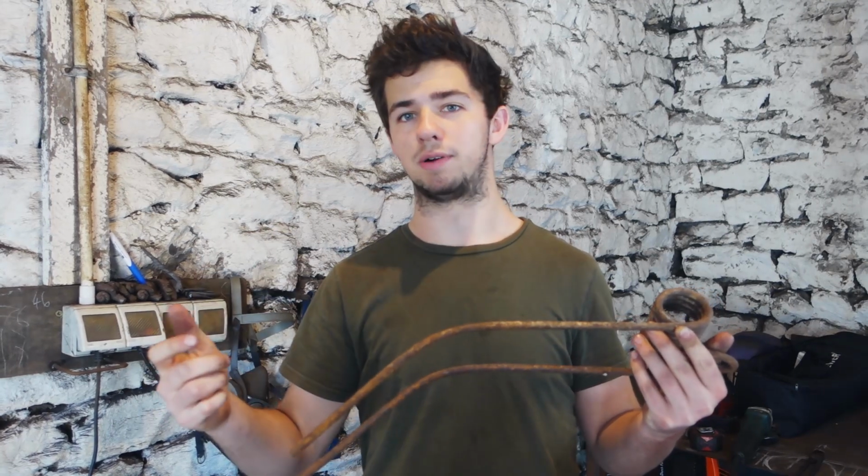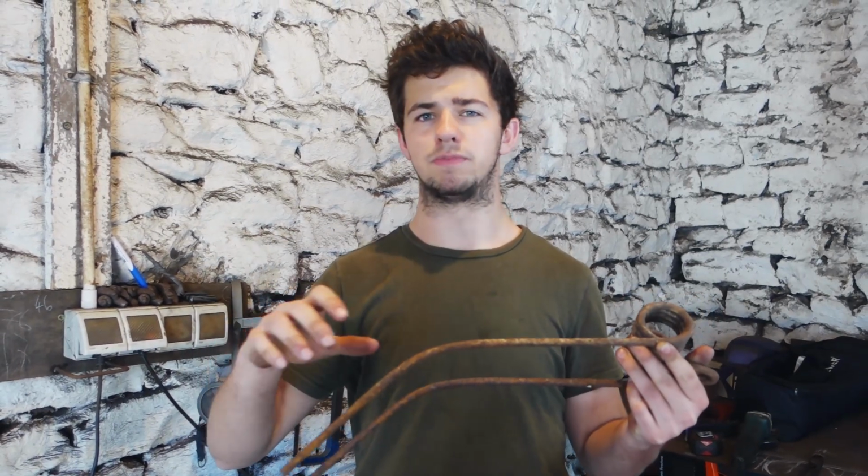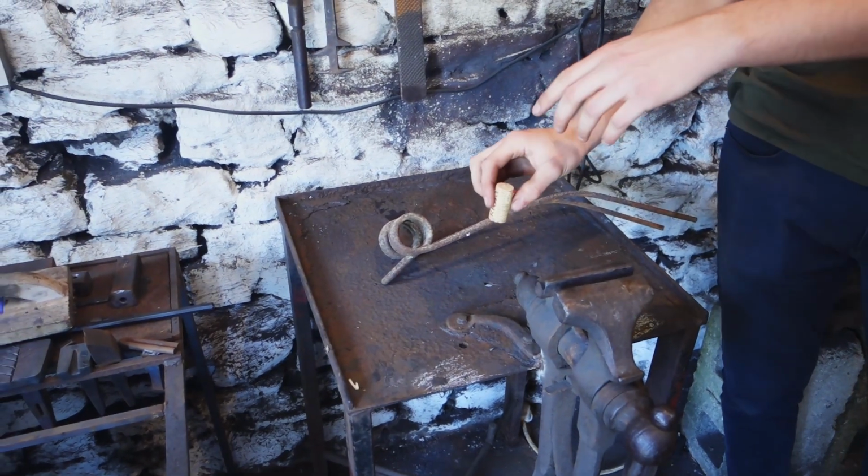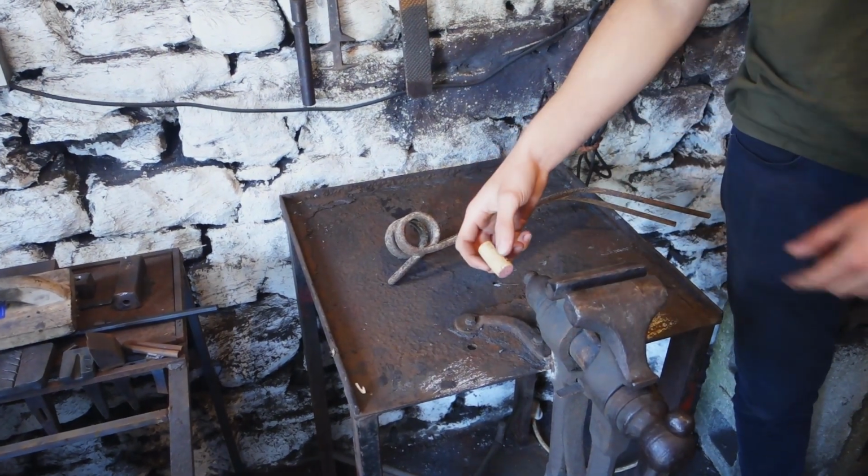you know, the screw out, and then the body of it we can forge our mild steel, as that doesn't really matter. But the screw sort of needs to be a bit harder so it can not bend as you're trying to pull the cork out itself. I also have a cork as well, just so I can get the size, the diameter of the screw right.